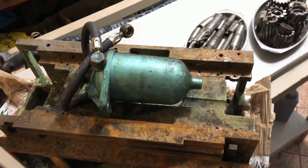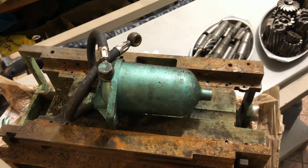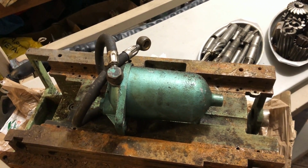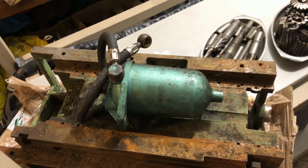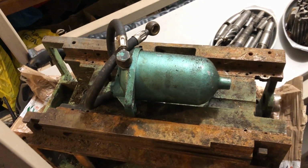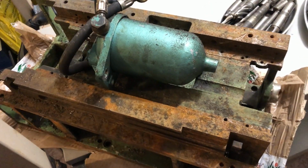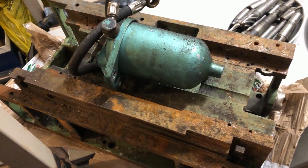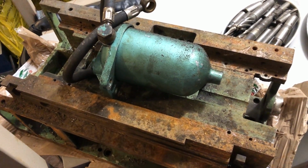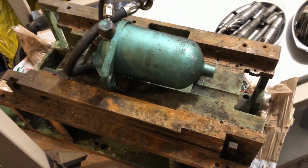It will also allow me to have two centers mounted and to use it as a shaft indicating jig, or rather metrology jig for shafting, to see if the axle is bent or whatever, or spindle, as axles and spindles are the most popular of all the machinist shafting, along with lead screws and threaded rods of other sorts.